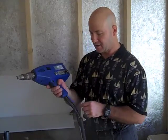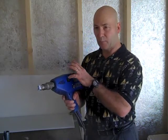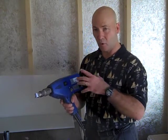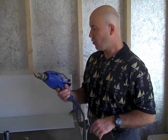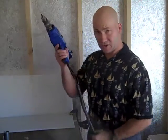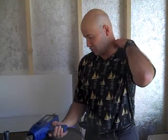What I wanted to do was talk about our Injecta Weld and our Extruder, which are more high production. The reason is these are self-feeding — the rod will feed in, break down inside, become molten, and it'll extrude or inject out of the tip. I'm going to do a little demonstration first with the Injecta Weld, and then we'll come back to the Extruder.